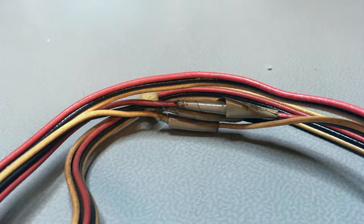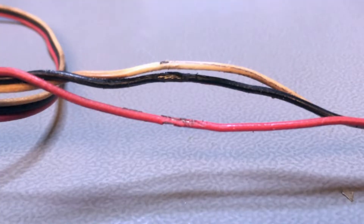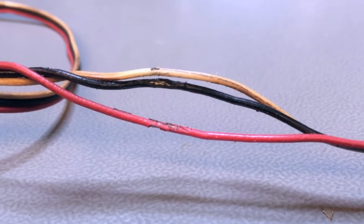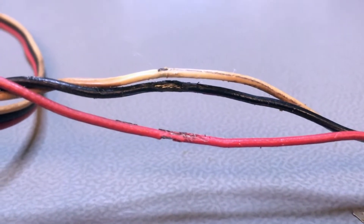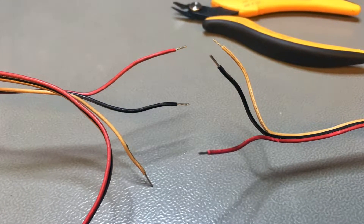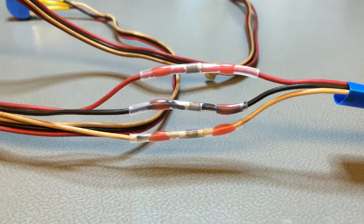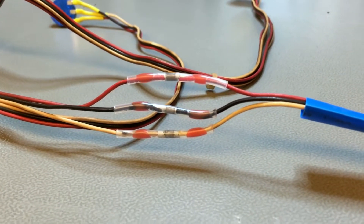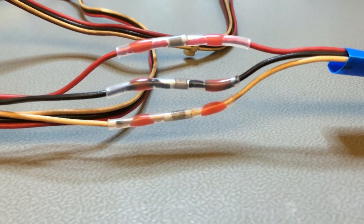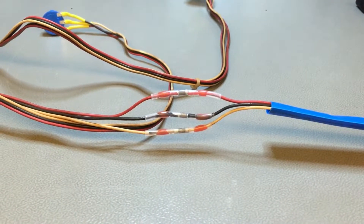This was suspicious — part of the cable assembly for the brightness and contrast potentiometers. I thought: were these cables broken and rejoined? But once I removed the electric tape, the cables had just been melted, probably because they were sitting against a heat sink. So wrapping with electric tape was appropriate at the time, but since I have it open, I did the right thing. I removed the damaged area, exposed new fresh wire, and remade the connections with waterproof connectors with embedded solder. These are better than the original wire. I also covered them with blue heat shrink.